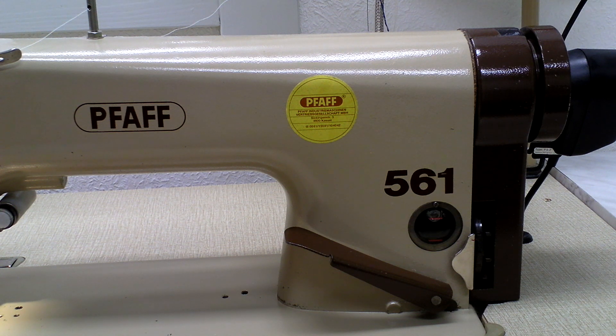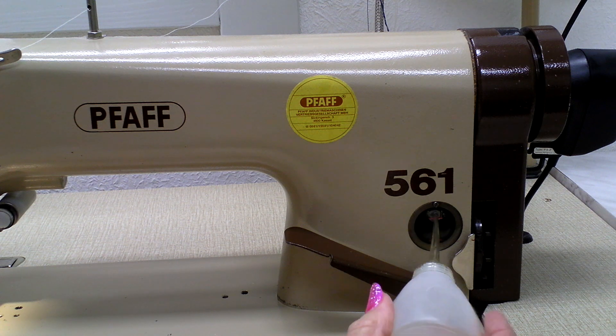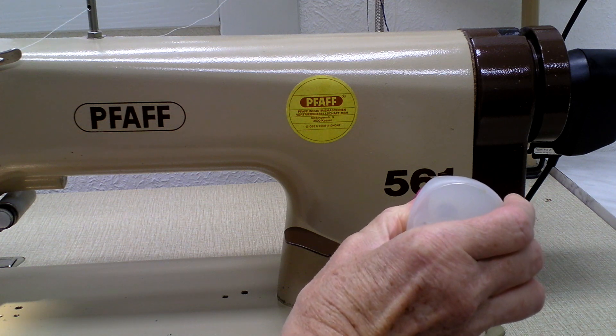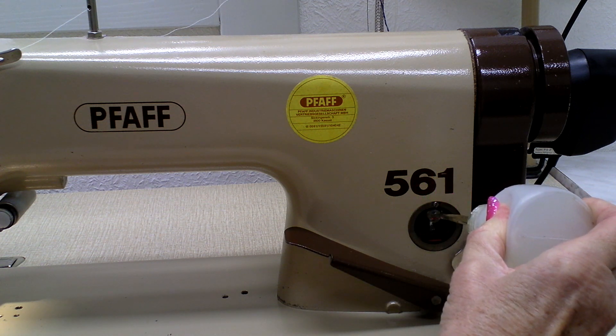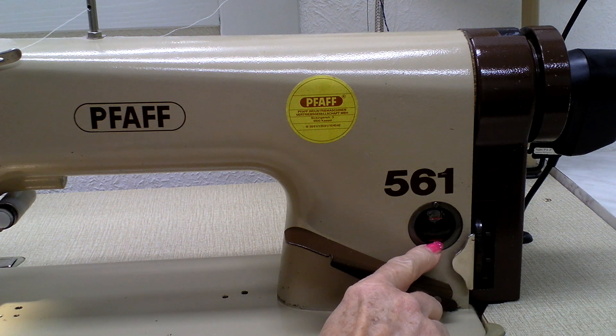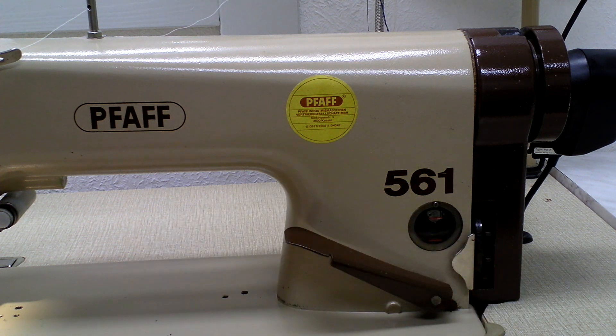Very important is that you have the right oil — it must be a special industrial machine oil, because there are loads of different ones, and that is more important than anything. Now you see what I'm doing: there is a little hole above the top marking line, and exactly that's where you fill the oil in. I like to keep my oil approximately between those two marks in the middle. You wouldn't fill it all the way — just keep it somewhere between the two marks.